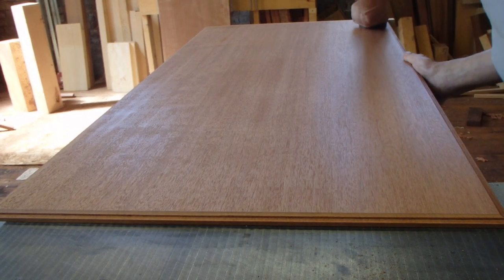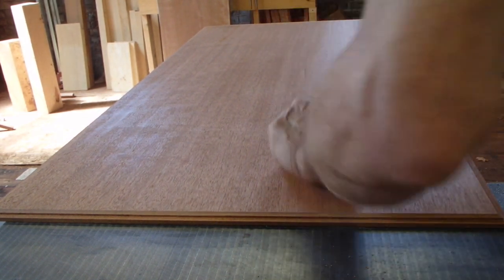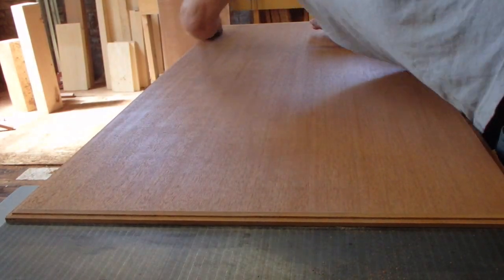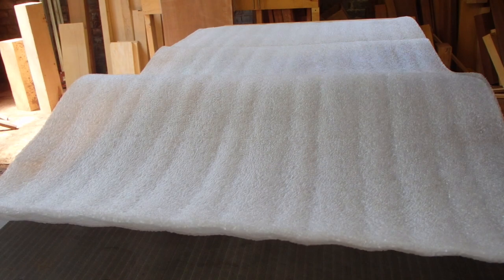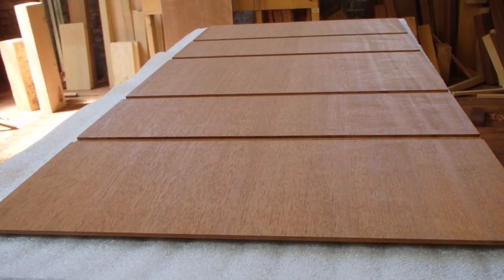Because this cabinet stores beddings, I didn't really want to use an oil-based finish, and a film-based finish would have meant certain parts of the cabinet would have been rather onerous to deal with. So I decided to take a risk, in this culture at least, and do what the Japanese would term shiraki, or white wood work. That is wood that is finished only with a plane. And I rubbed some wax on it for a little protection against dirt. But otherwise, this cabinet is basically au naturel.